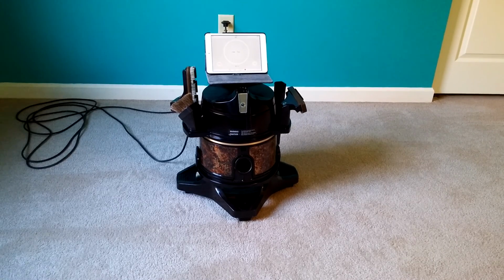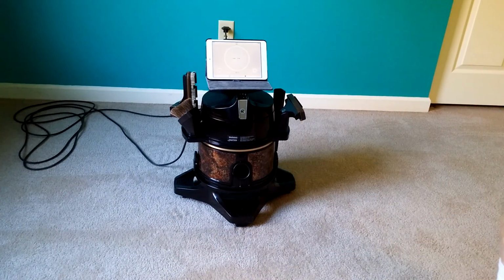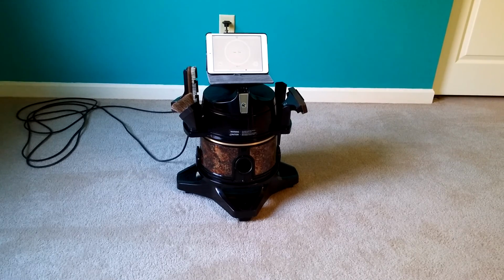Well, so you're looking at a room that's 960 cubic feet. Subtract 60 cubic feet for a bed and a dresser, and you're down to 900 cubic feet. Right here, the nozzle intake, you're looking at 87 CFM, and it'll do that all day long. And yes, I've got fresh, clean, cold water, and it's filled to the right level, and so on and so forth. So I figure about 10 minutes, and it should cycle through just about the entire room as far as air. So let's take a look at initial conditions.